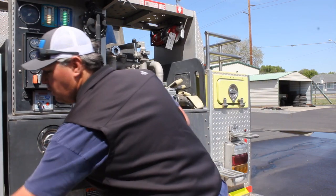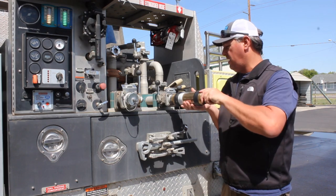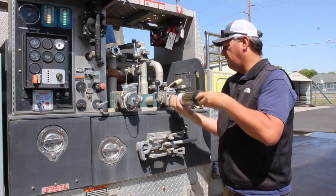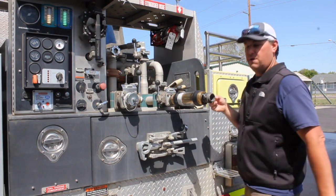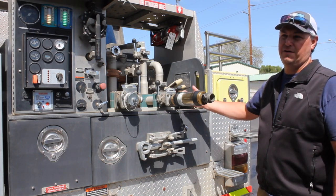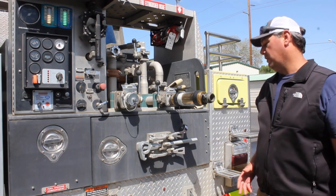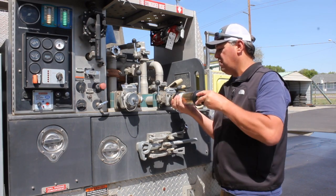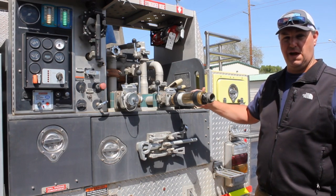What I would normally do for this kind of pump test is attach my flow meter to my discharge. You could put a hose in there, and then you don't have that whole concept of putting things on Mark III. But this is high quality stuff, not that cast aluminum off the edge of Mark III. Anyway, we're going to go direct. And look, we can even read our gauge here. That's good. When this flows, this little black line in the white will move up to show us what the actual flow is.